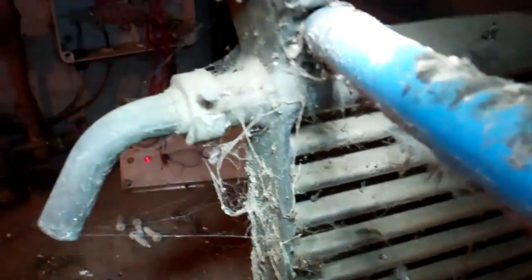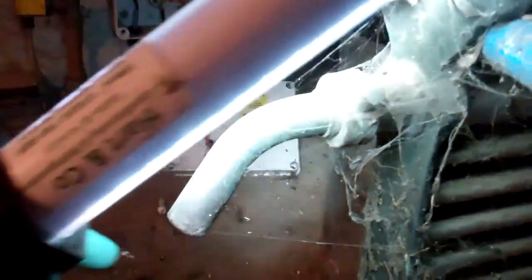I just spotted this as well. It's an old milk cooler. You'd run the mains water through — it would come in here, I suppose. It might come in the bottom, actually, and come out the top. That would make more sense. And then I think there was a little hopper that you'd sit like that where the torch is, and that's where your milk went. And the milk would trickle down the outside over the stainless steel fins into the little trough at the bottom and out.